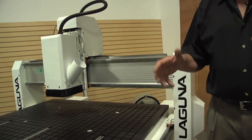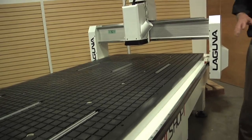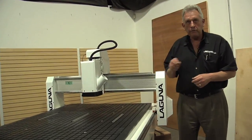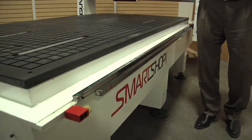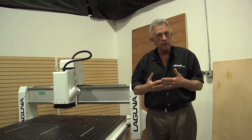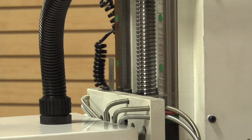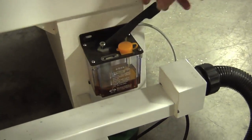This is a Laguna Smart Shop one CNC. We're really proud of the engineering accomplishments we achieved when designing this machine. We've already looked at how the base frame is one welded structure and why we get good edge finishes and accuracy. Another important component is the motion control. We're using contoured guide rails in all three axes. In X and Y, we use a helical rack and pinion — that's important because with helical rack and pinion you have constant mesh and they're a lot smoother. On the Z axis, we use a precision ground ball screw. We also made lubrication very simple by including centralized lubrication.